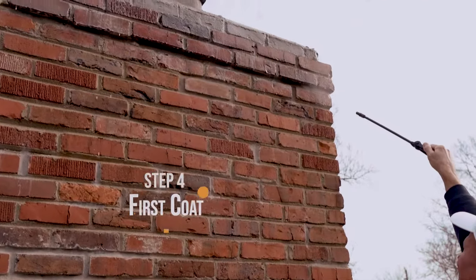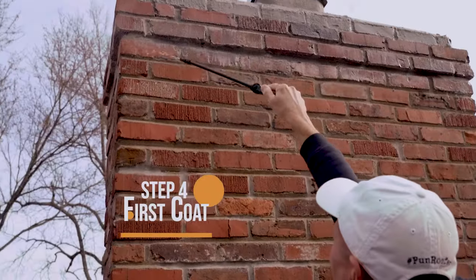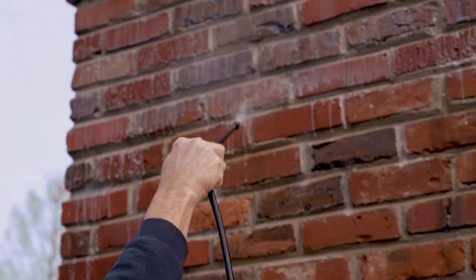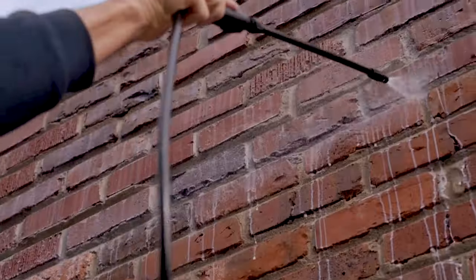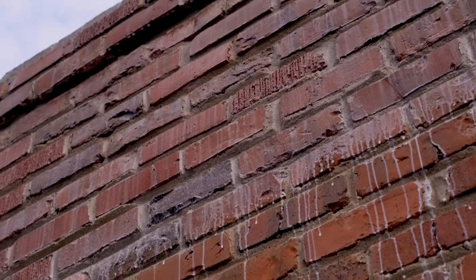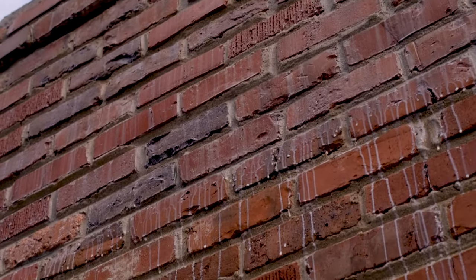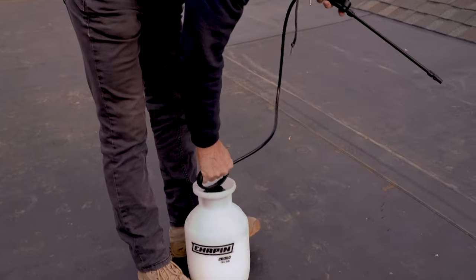What I'm wanting to do is put three coats on here wet on wet. That first coat is going to soak in almost immediately. Then we'll come back around and the second coat is going to soak in some. The third coat is going to soak in just a little — most of it's going to try and run off. This is just a masonry water repellent.